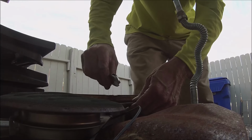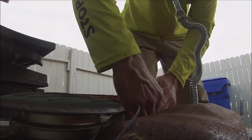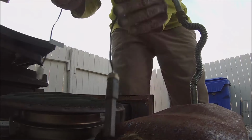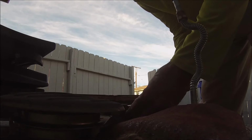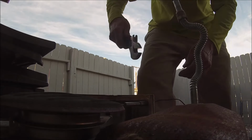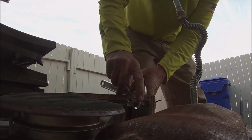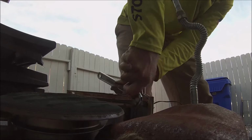It's kind of like a piece of brass that gets very close to the burner assembly there. It's about 3 inches long, and you just unscrew it. That's the old sensor, that's the new sensor, and I just put the new sensor in. It's actually a used sensor off of another water heater. So when I get water heaters where the tanks are bad, I keep the burner assemblies with all the sensors in them and reuse them whenever I run into these code 9s.